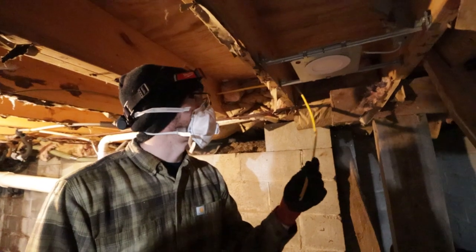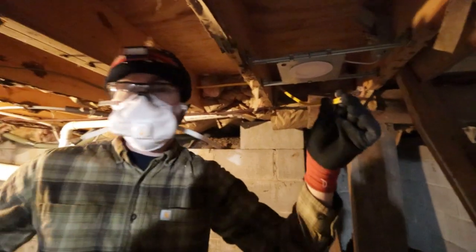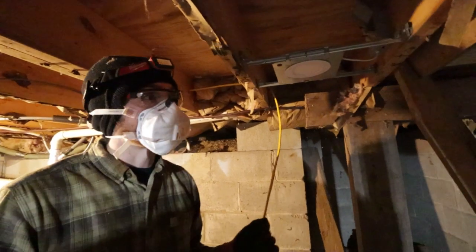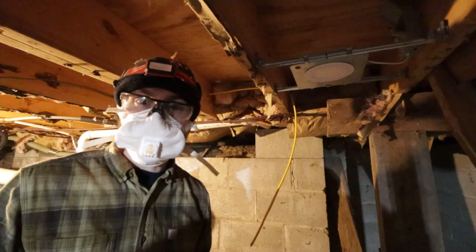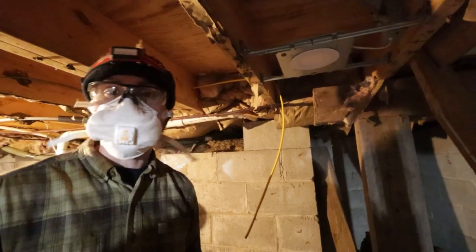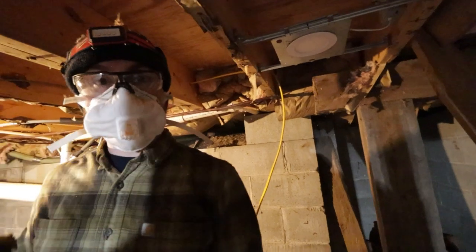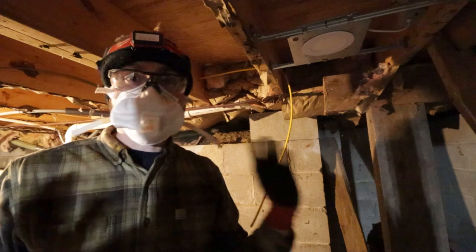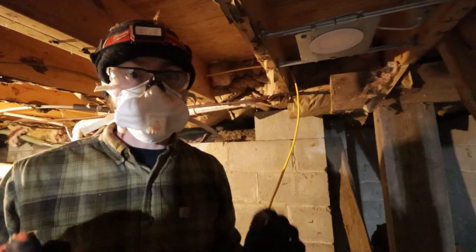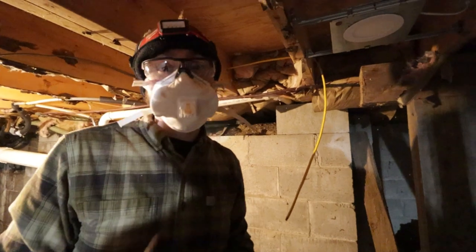And essentially what's gonna happen is either we come into this box and daisy chain all the lights. However, I might not wire it that way if this was in like a living space, because if you put a dimmer on it, you'll notice if they're not at full blast, this light will come on, and it'll go down the chain. So you kind of want to split it up to balance how the power gets delivered to each light instead of going through every single light. I haven't tested if that makes that much of a difference, but I believe it does.